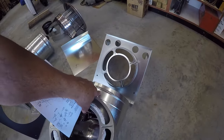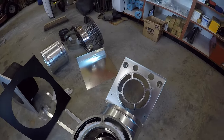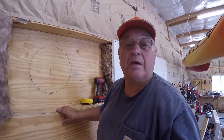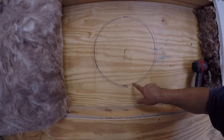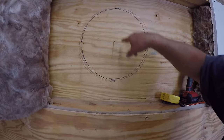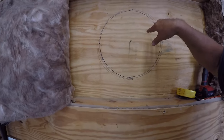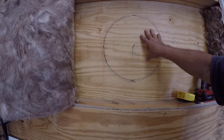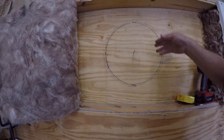The T sits on top once I get it through the wall, and this piece goes back inside the building on the wall-facing end. Then it will all come up from there. Putting this stove pipe through the wall — I've got my circle drawn here, that's a 14 and a quarter inch across circle, so I've got to cut out that black line and go through the wall. I've taken my siding off the outside so I won't cut into my siding.